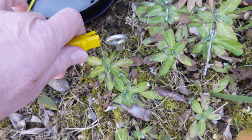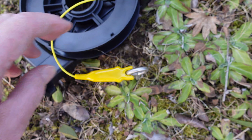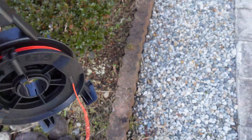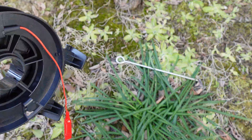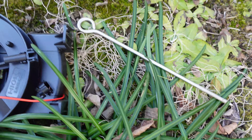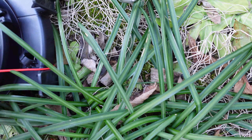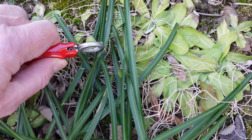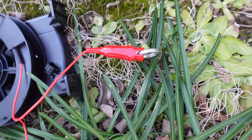In my garden I can space them about six meters apart, so that's what I'm doing. Here we are connecting the first auxiliary ground rod and making sure the connection is good. Now we'll do the same thing for the second auxiliary ground rod, which will be placed a total of twelve meters away from our main ground rod — another six meters away from the first auxiliary ground rod — all in a straight line.